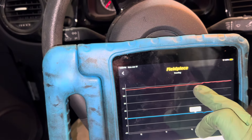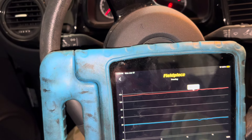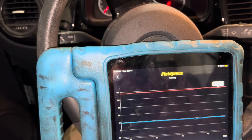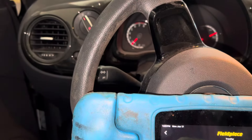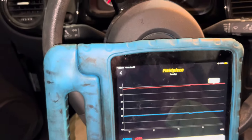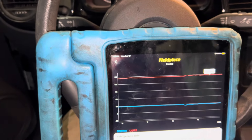Computer took over. I think we gained a little bit on the high side — 146 before I hit the gas pedal, 147 after. So we gained a PSI by going between 1,500 and 1,700–2,000 RPMs. So what did RPMs do to the compressor? Absolutely nothing.